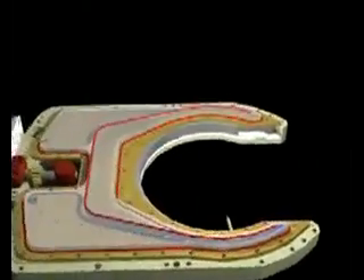All Orbi-Matic weld heads have a unique cooling system that lets the water flow up into the weld head body through a fine cooling channel system that reduces heat and in turn prolongs the lifetime of the weld head.